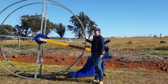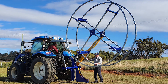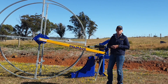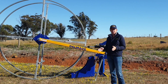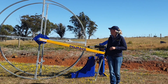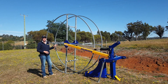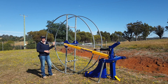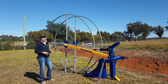The next thing to take into account is your reel size. We offer two options: the 2.8 metre and the 3.2 metre. The best thing to do is talk to your rural dealer or go and measure a roll of pipe yourself to make sure it's going to fit. There are three measurements you want to get: the internal diameter of the pipe roll, the external diameter, and the width. In most situations, the 2.8 metre reel is going to suit most jobs — it accommodates a 300 metre roll of 2 inch pipe with no worries. It's only if you're moving into bigger jobs that the 3.2 metre becomes a consideration.